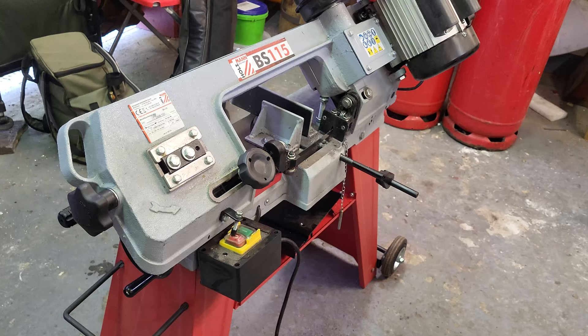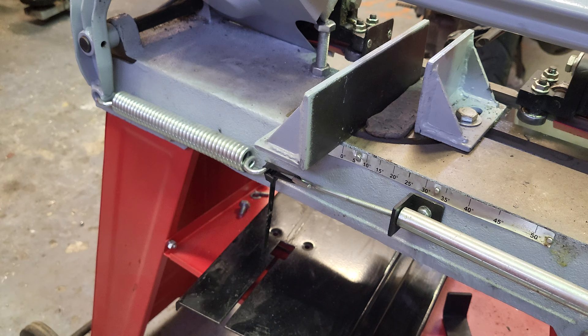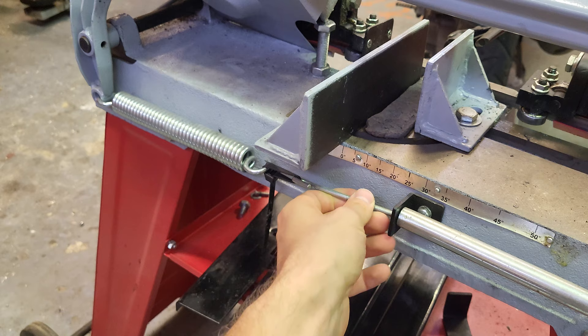After the belt tension is set up correctly, it's not an issue anymore. Now we get to the issues. The largest one, as you can probably see by the cable ties, is the tensioning mechanism — this controls the force that gets applied to the saw when it's in the cutoff position. This thing came completely bent. This screw right here, as you can see, if I turn it, it's just wobbling about.